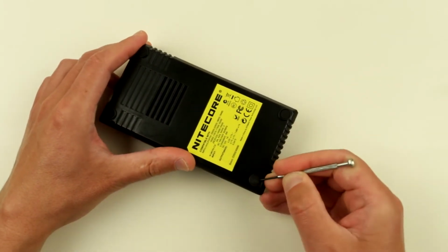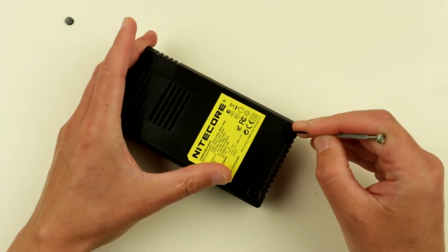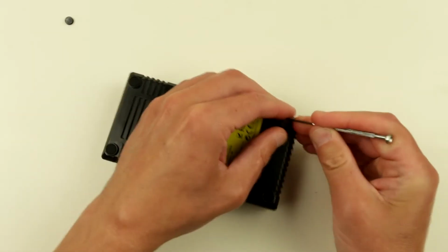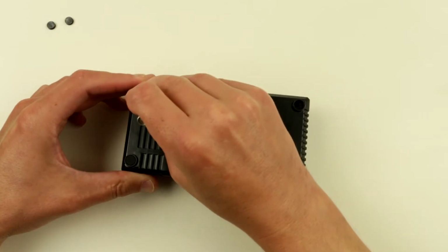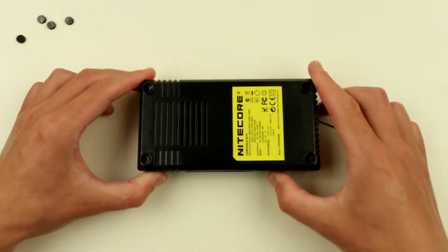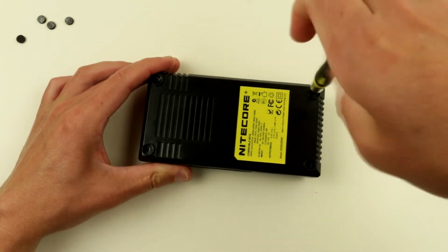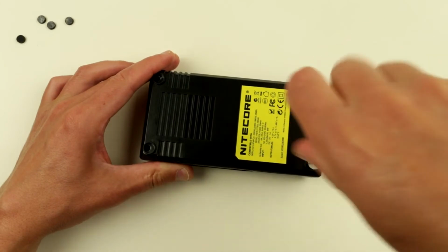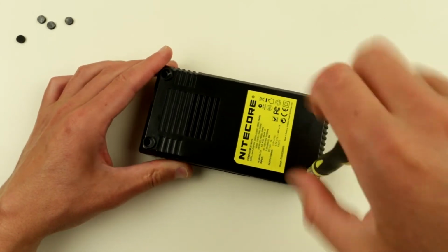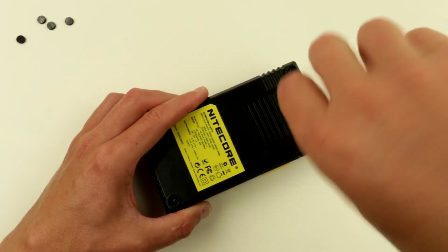Okay, I have this teeny tiny screwdriver. I'm gonna pry. Yep, we have screw holes. Nice. Okay, that's not giving up easily. Regular Phillips screws. Take my screwdriver here. They are not too deep, so I'm okay with this stubby screwdriver. Four screws, self-tapped into plastic, highly likely, because that's a cheap product, and it's very cheap to do self-tappers. No one is actually gonna be opening and closing this thing more than once, or ever.